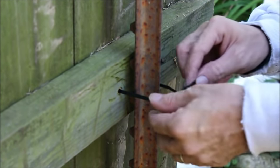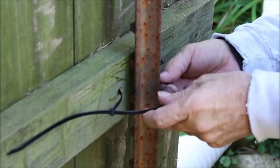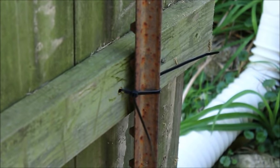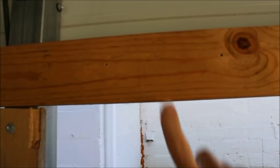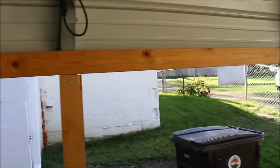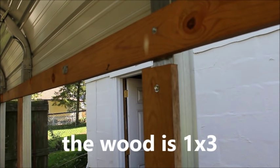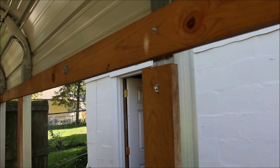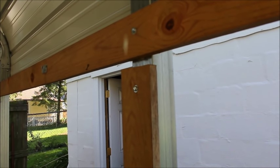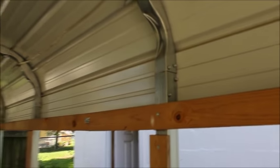We cut it off there. I labeled the panels one and two going down, so it's like two and three — there are four panels on this side. You number the panels and you number the side. Remember the one-by-threes are already up; I leave them up all year, they're just up the frame. You use sheet metal screws and anchor them to the steel framing of your carport, that way you've got the frame in place all the time.